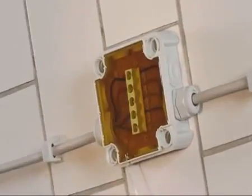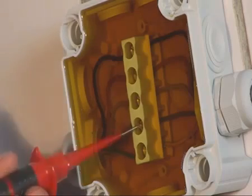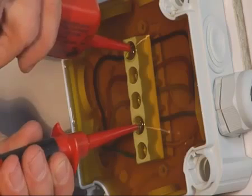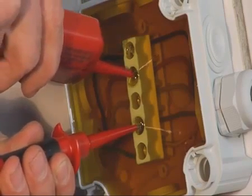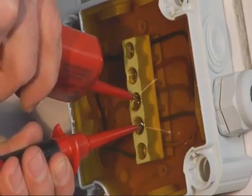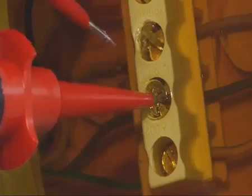The Acquisite gel is a cold casting compound of a soft elastic consistency, which makes its removal at a later point and retro installations possible. Acquisite is repairable and also self-sealing, meaning electrical connections can be tested easily and quickly even after installation, and can be mended quickly if required.